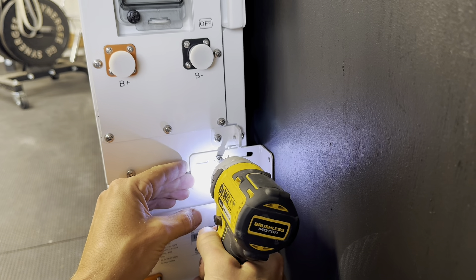My goal with this system is to control specific power needs in case of a short or long-term grid problem — meaning if we don't have power from our provider, we'll be all good. This system will also control a complete off-grid setup; you could sell back excess energy to your provider if they have a program for that. I'm configuring this system to tie into specific breakers in my main panel to power our well pump, freezer, fridge, the electric side of our propane appliances, and some lights and outlets. The batteries store DC power which can be created via the sun. Having a proper solar array allows me to capture that energy and save it. If the sun isn't shining, I'll have a dedicated breaker in my main panel to charge the batteries, plus I can attach a generator — this inverter can do it all.